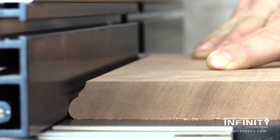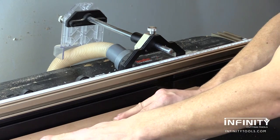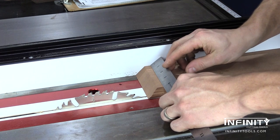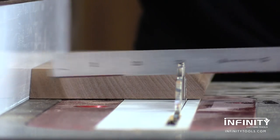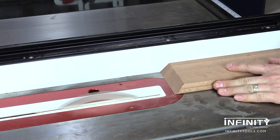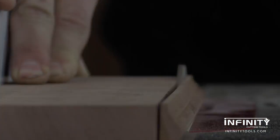When using a molding profile bit at the router table that is not bearing guided, it's always a good idea to make a test cut before running your pieces that we've already mitered. Once I have this profile cut, it's back over to the table saw to rip the molding free. I set my fence using a ruler to ensure that I have the proper thickness for my molding — in this case it's about a half of an inch — and then I use an Infinity combination blade to rip my molding free from the rest of my case stock.